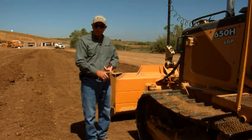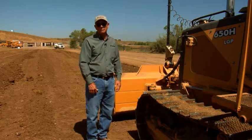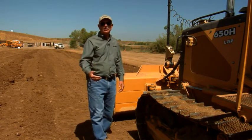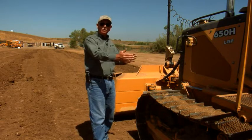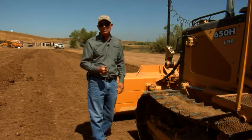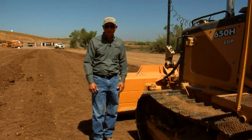So first of all, we've got the nature of the dozer itself to deal with. And secondly, when it comes to GPS control, even at a 10 hertz update, the dozer, when traveling, has moved several inches before we get a new update position from GPS. So how do we solve that? We solve that by doing something totally different, totally revolutionary, which is 3DMC squared.